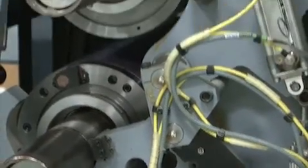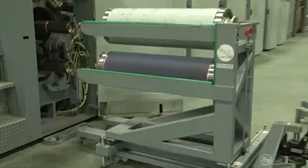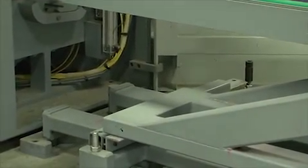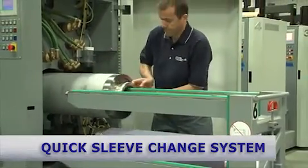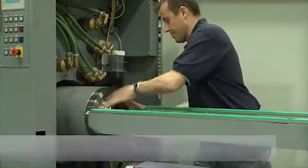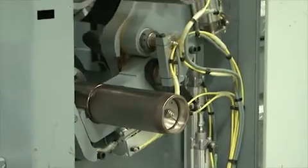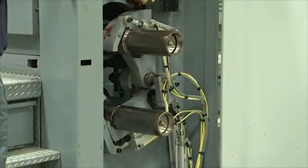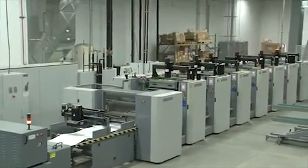The unique lock-up system prevents any movement during the printing operation of the sleeve or the shaft. The press side frame is opened, allowing the safety-first trolley to roll up and lock into the correct position for a quick and accurate make-ready. The Komori sleeve is then pulled from the unit quickly with ease. The reverse pattern is used to insert the sleeve and locate the locking pin. The side frame locking clamps are closed firmly, locking in the sleeves. Once the print unit has been pre-set and loaded with the new sleeve technology, the press is started within a minimal print length, and the press technology inspects the print using a full-array camera system, measuring it against a master proof.